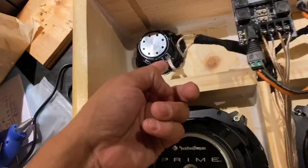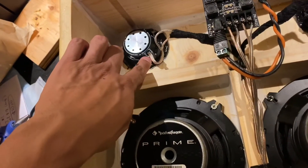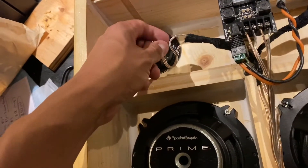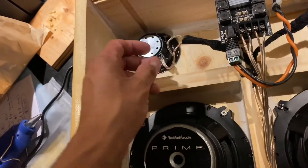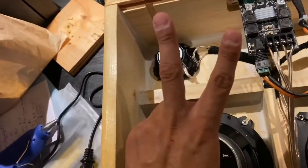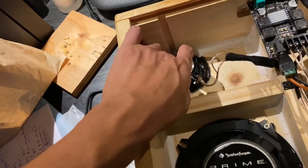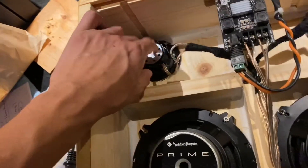I also added glue because I didn't have the right connector. I went ahead and heated up this 16-gauge wire with just a lighter and pushed it into the two pins. These are OEM connectors from a 2015 Honda that I was working on.